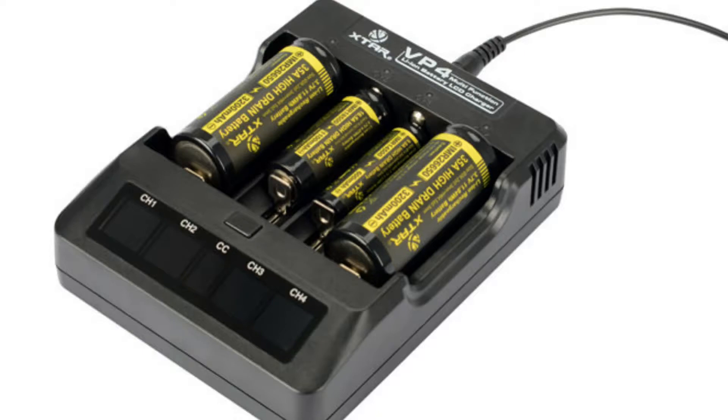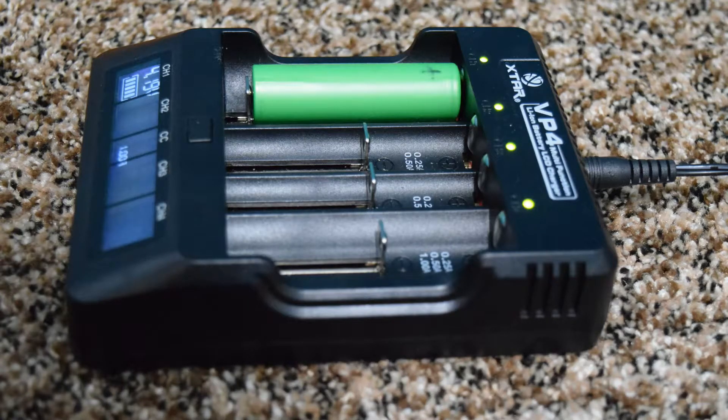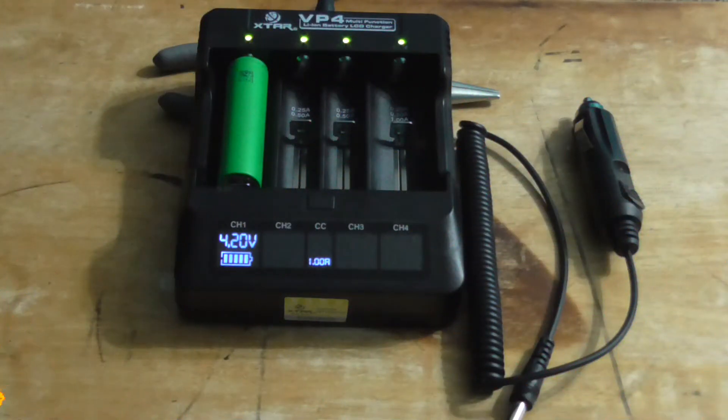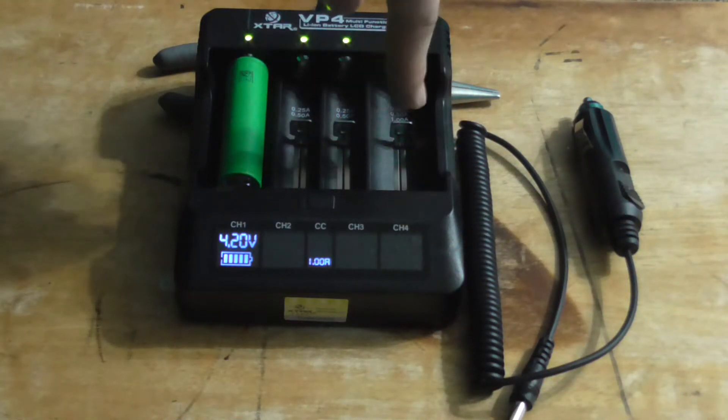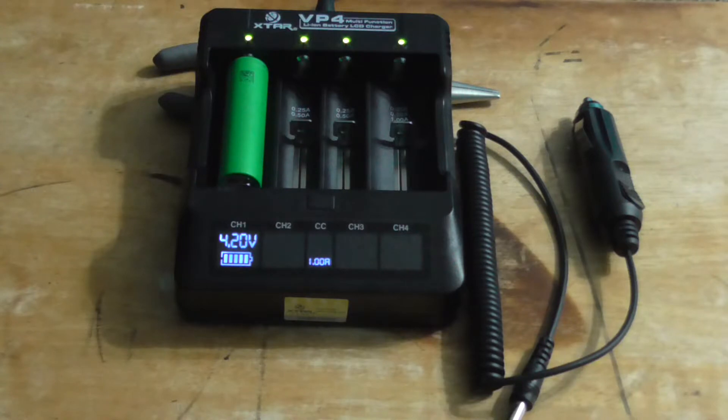Generally IMRs are unprotected. It's got independent channels, so if you plug four batteries into this thing, it's not going to suck power away from another channel. Just because you need to charge multiple batteries, you don't have to sacrifice time. If this battery right here is almost done and I plug in three more batteries, it doesn't matter — this battery will still be done in the same amount of time. The channels are independent and they don't care what the other channels are doing.